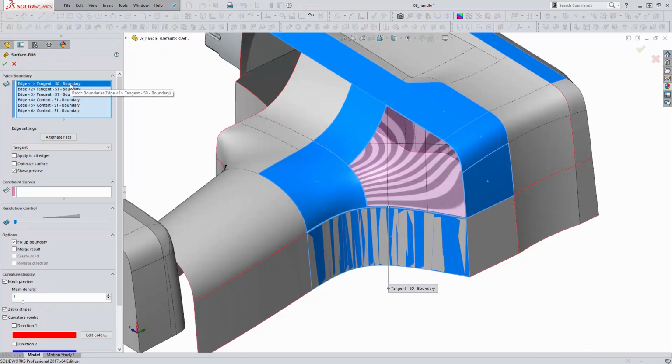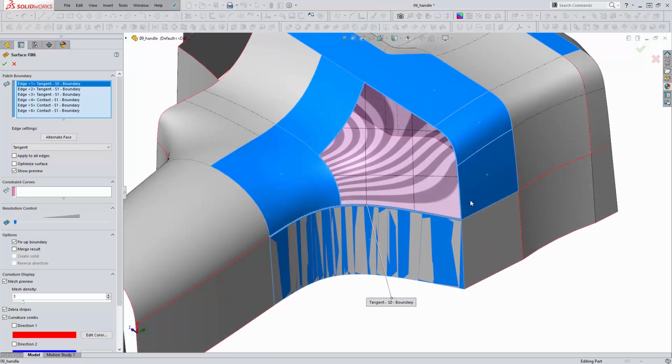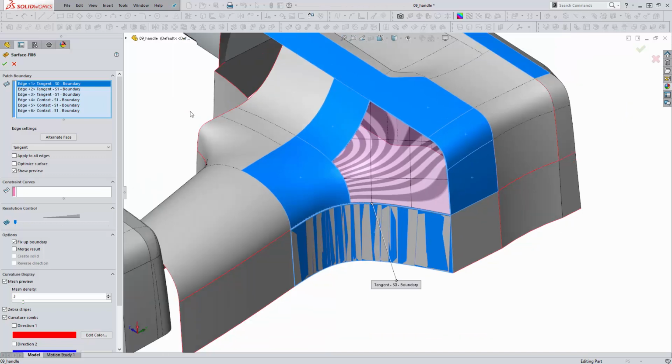Ultimately, I only need a tangent on the surface fill, and I'm setting tangency to the draft reference surface here, this existing model edge of the handle, this existing model edge, and then these 3 edges of the top shape. I'm not going to be using a guide surface because the result I got was more than acceptable, so I'm just setting these to contact end condition.